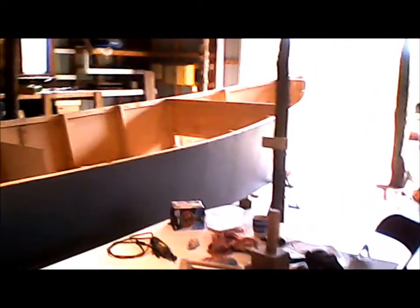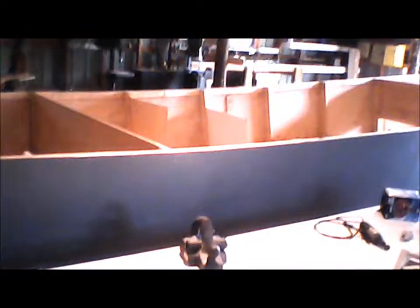I'm also going to need to cut out a space right here for the Samson post to come out, because the Samson post is actually secured to Frame A all the way to the keel. Not a big deal — still pretty easy to do. I won't permanently affix it until I've done all that little stuff. Anyway, that's what was on the docket today, and with that drying, that'll conclude it. I'm pretty pleased with how everything's coming together. Epoxy should be here in about a week or so, and then I can continue on the inside of the boat. Until then, I will see you guys then.